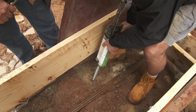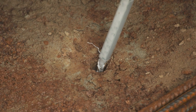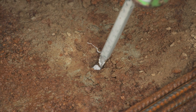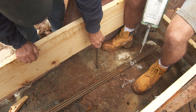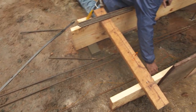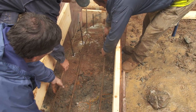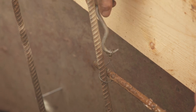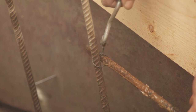You can see the epoxy coming up inside the hole there. Now before the epoxy sets — and it's going to set pretty quick; on a cool day like this it sets a little slower — just push the rebar right into the wet epoxy, and then we'll do the next one. So the dowels are into the ledge with epoxy. Next thing is we have to run horizontal rebar, three pieces across here. We're wiring them to that, and they want to be in about the lower third of the pour. That's the weakest part, so we want to make sure it's reinforced.